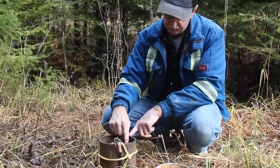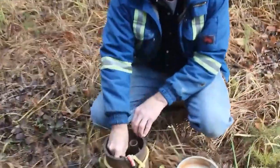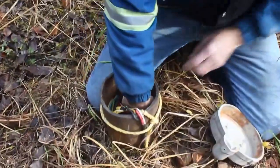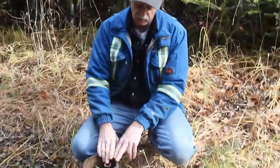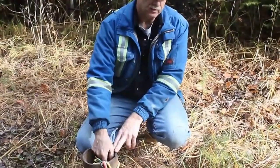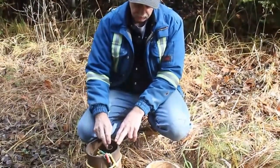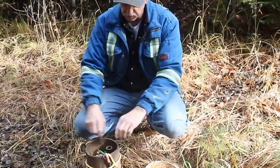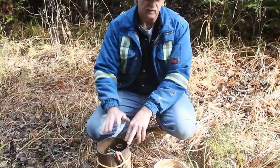This little piece of pipe in here is a pitless handle. In a very shallow well, that's fine — you can reach down inside and grab hold of it and pull it out. But if it's a deeper well, you would never be able to hold it once it came off the pitless. Generally there's a threaded fitting on here that you can thread a T-handle through that goes across the casing, so once you get it off the pitless it can't fall down the well on you.